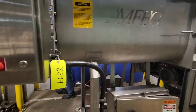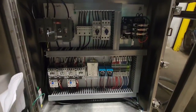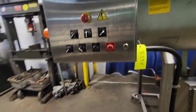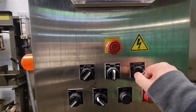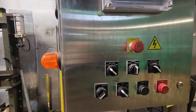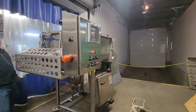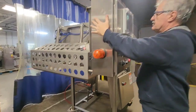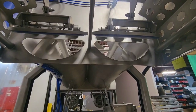The last function we'll show you is the unloading. Take a quick look in the control panel here. We'll go ahead and stop the machine, open both the right door and left door. Silvio will go ahead and show the unloading feature with the momentary switches — you have to press both switches at the same time, which will allow you to unload the product.